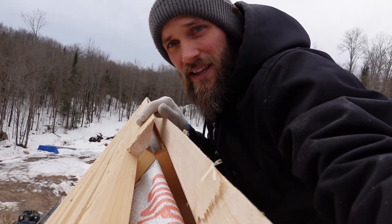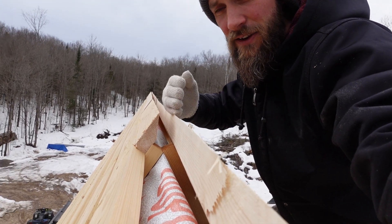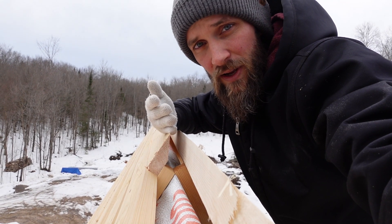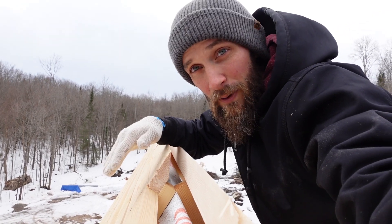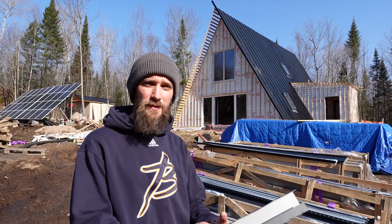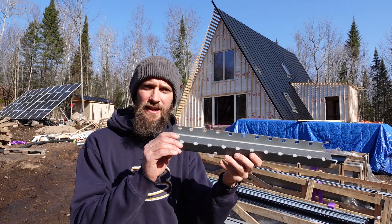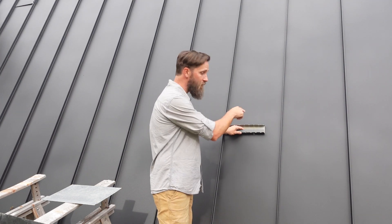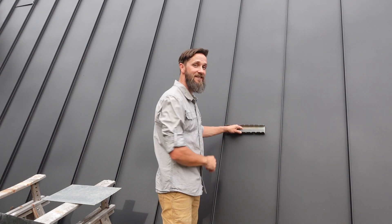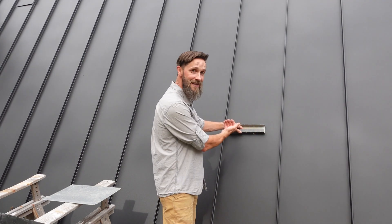By adding four inches of strapping here and on the other side too, I'll actually be able to bring the steel all the way up to the top. There's still a gap there, so it's a vented airspace that comes up the house wrap and out the top. After attaching the steel, we'll put a rectangular piece along the edge and attach the ridge cap on top of it. These connecting pieces go between your ribs and get screwed down into the strapping. The ridge cap comes down on top, gets screwed in, prevents rodents from getting in, and also allows air to vent out rather than being trapped underneath the ridge cap.